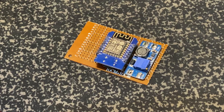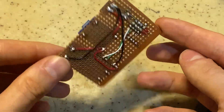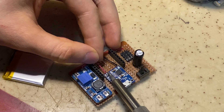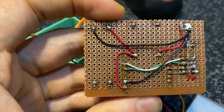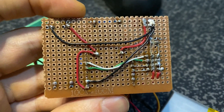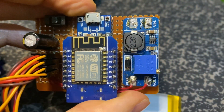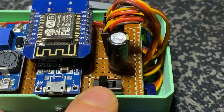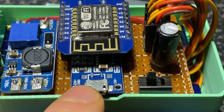Let's continue with the circuit board. I made a very simple one as a proof of concept, as you can see on the screen. The voltage booster powers the servos because they need 5 volts. The ESP8266 is supplied directly from the battery through the 5-volt pin. I added a capacitor to the servo power line — be careful with the polarity. Servos draw a high current at startup, and this capacitor helps balance the power delivery. I also added a power switch and a battery charger board.